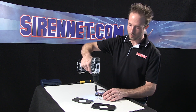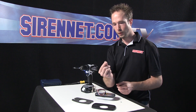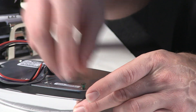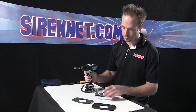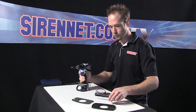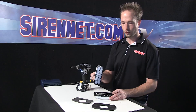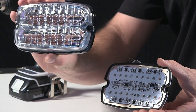As I'm removing the screws, you may notice that the top has a bit of a green compound. It's actually an epoxy sealant to help the top of the screw head seal the hole that it sets into. Again, keeps grime, extra condensation, and so on from potentially getting into the light head. With the six perimeter screws removed, the LED and aluminum extrusion frees itself from the front lens.